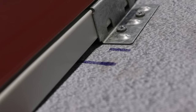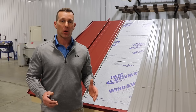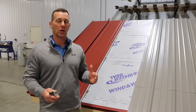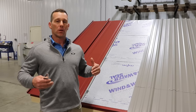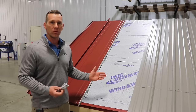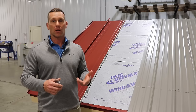All metal roofing moves with thermal expansion and contraction from daytime heating and cooling. One of the big differences between standing seam and corrugated metal is that standing seam allows this movement because the screws go into the clip, not the metal. The metal can slide up and down the clips, moving without breaking the watertight seals around transitions, trims, ridges, and valleys.